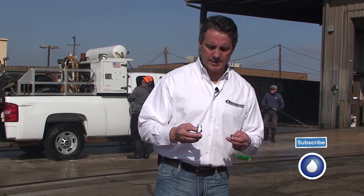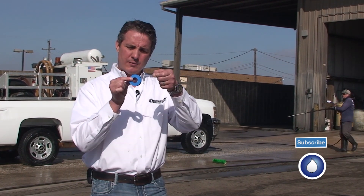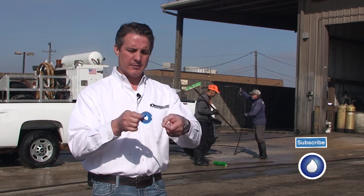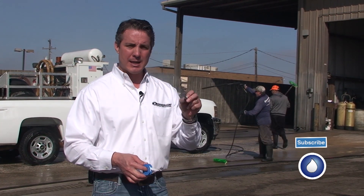You'll find it everywhere. Most hardware stores will carry it. We carry it at PowerWash.com. But I'm going to show you how to apply this. So we take the PTFE thread seal tape, and I like to set it where it rolls from the top of the thread, from the roll, out. And then I'll hold the item I'm going to wrap in my left hand.